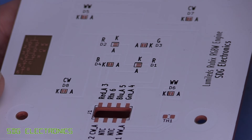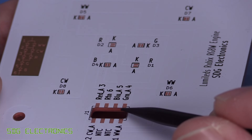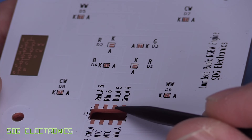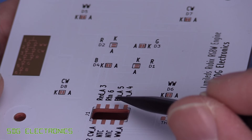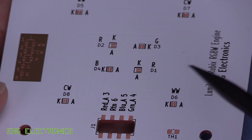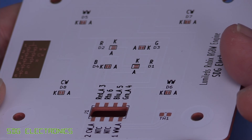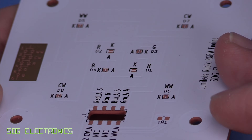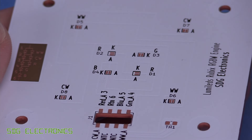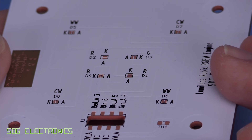Here is the result. I've probably made a slight mistake — I should have added a little bit of solder mask to the edge here, because if any solder paste dribbles down the side we're going to short out onto the copper core. So we just need to be cautious with the amount of paste we apply. I also want to sacrifice one board to check it reflows properly in the oven, because I'm not sure if all of this thermal mass will mean we need to extend the reflow profile. Then we're going to assemble up two of the boards.